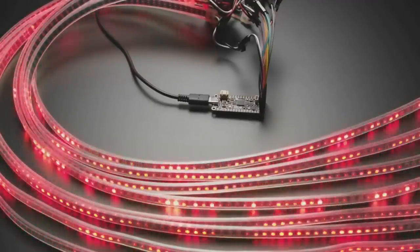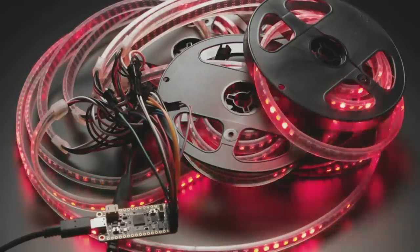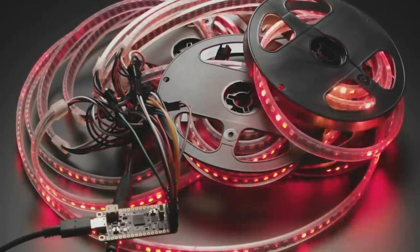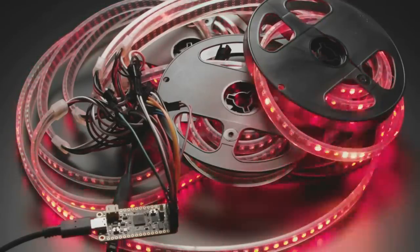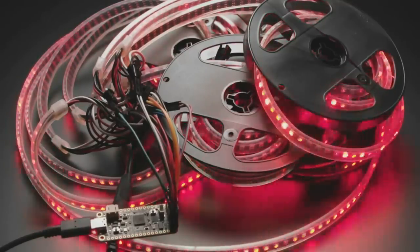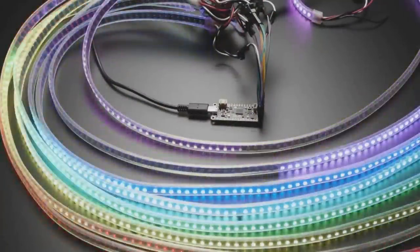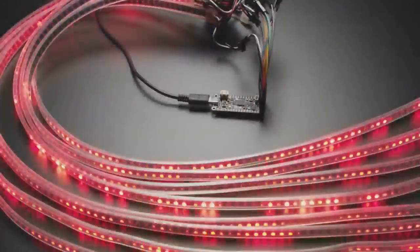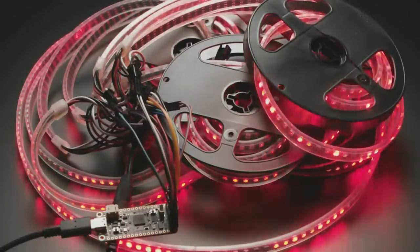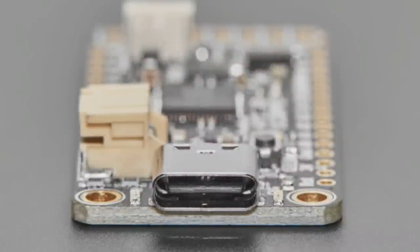Those contiguous pins are really great for driving lots of NeoPixels, especially since the RP2040 has 264KB of RAM and an excellent PIO state machine for NeoPixel driving. It's dual-core, so you can DMA your NeoPixel data on one core and do extra computation on the other — like fetching Wi-Fi data to adjust what's displayed on your NeoPixels. This board is specifically designed for when you want a Feather with RP2040 to drive a ton of NeoPixels, and we have both Arduino and CircuitPython code with DMA support so your processor isn't held hostage toggling pins. It has USB-C and battery support.